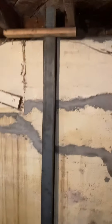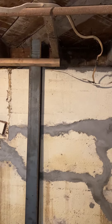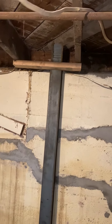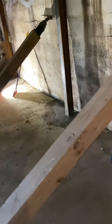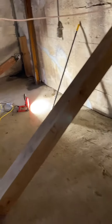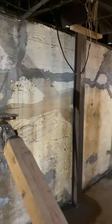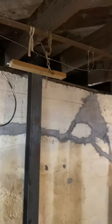King Piers, north wall in clay — we just got these H-beams up in there holding this wall to where we got it pushed back. That wood there is just temporary. Got the bottoms all cut in and looking good — we saw-cut our holes, we don't just jackhammer a floor. Take a good look at the first video after the concrete dries and we get the tops locked in — King Piers methodology.